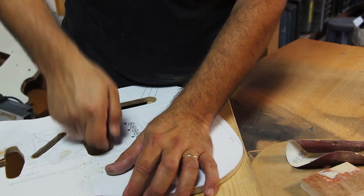I'll start with the neck. I'm going for a laminated neck — if you don't have a good quarter-sawn piece of lumber, a laminated neck may be your best choice for a stable and warp-free neck. I also like the way it looks. If you plan on using a one-piece neck you can skip the lamination part; it's all the same after that. I also go into much more detail on the lamination process in a separate video linked below and up here.